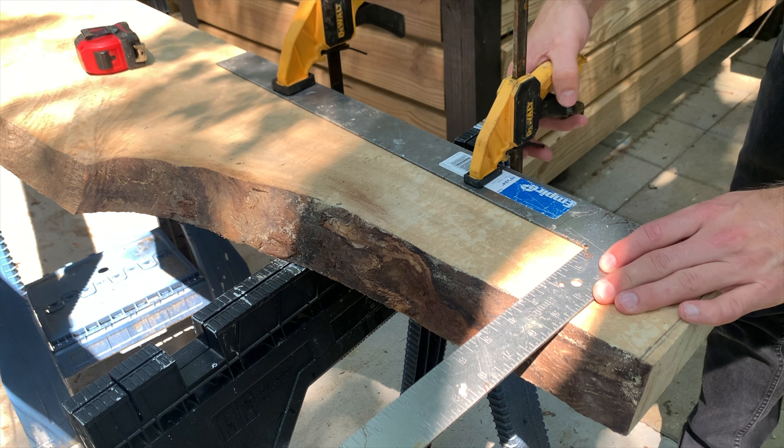Because these forms are going to be holding liquid epoxy, you definitely want to seal all the edges with silicone caulk. You don't want epoxy leaking through the forms onto your floor — it's going to be an expensive, painful mess to clean up. Once the form is caulked and hopefully leak-proof, position the slabs in place to see how everything looks. I took a pencil and marked the outline of the slabs to indicate where epoxy would contact the melamine, and then I put down Tyvek tape since Tyvek tape and epoxy do not stick to each other.